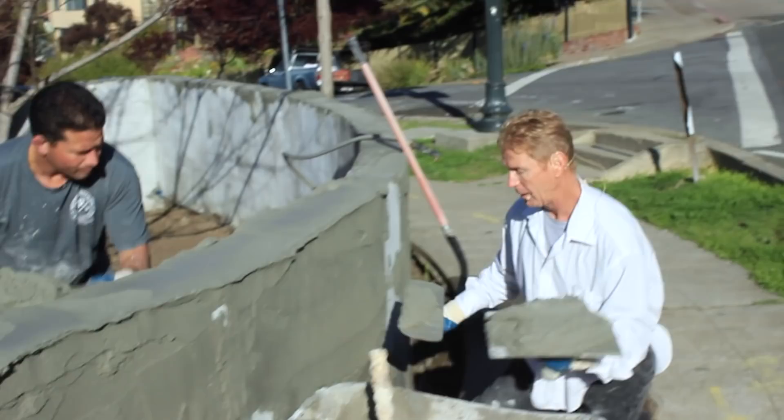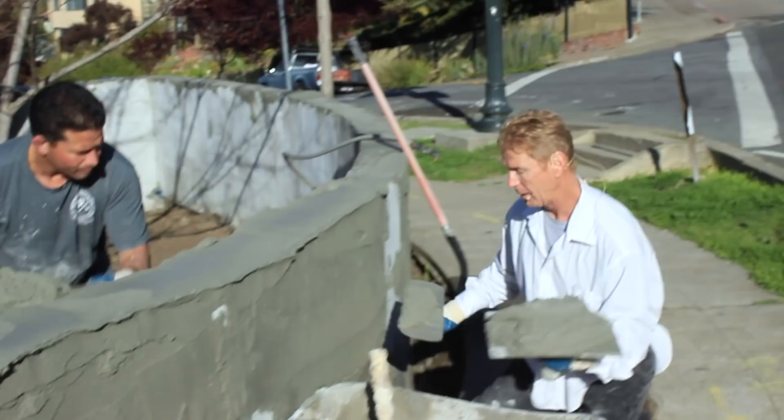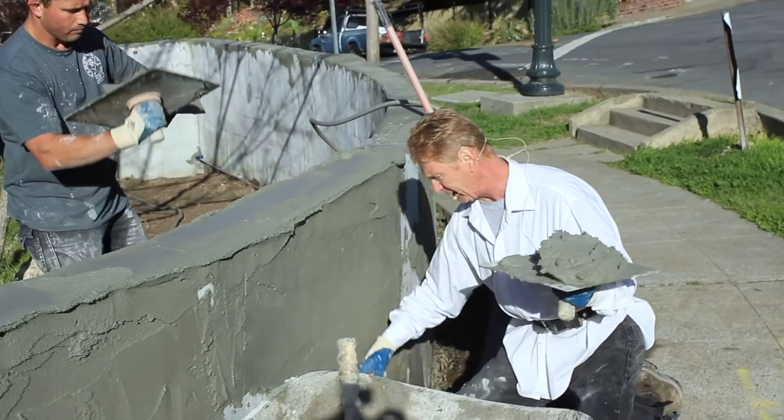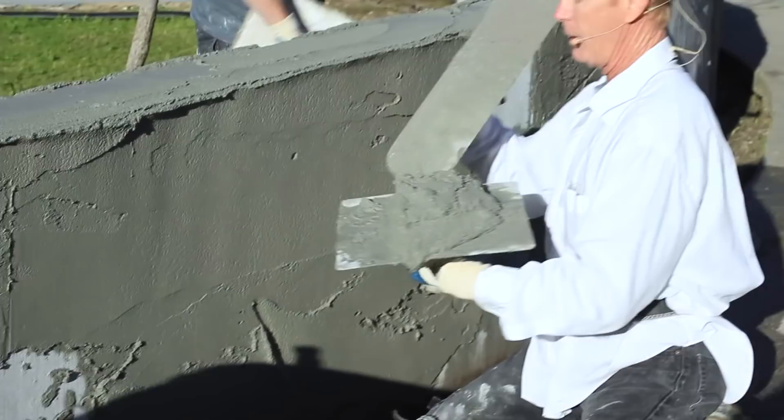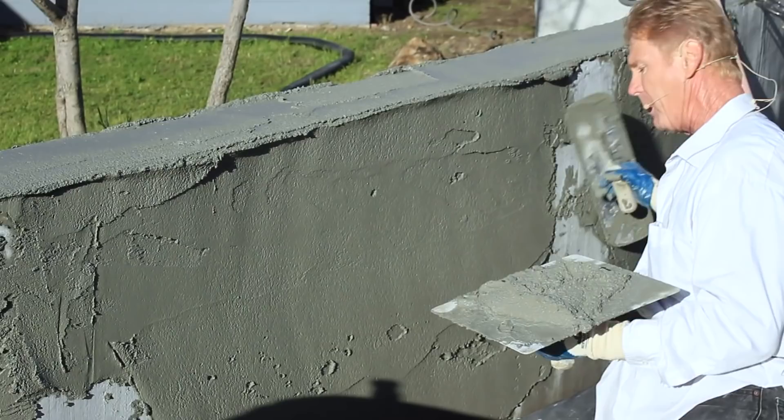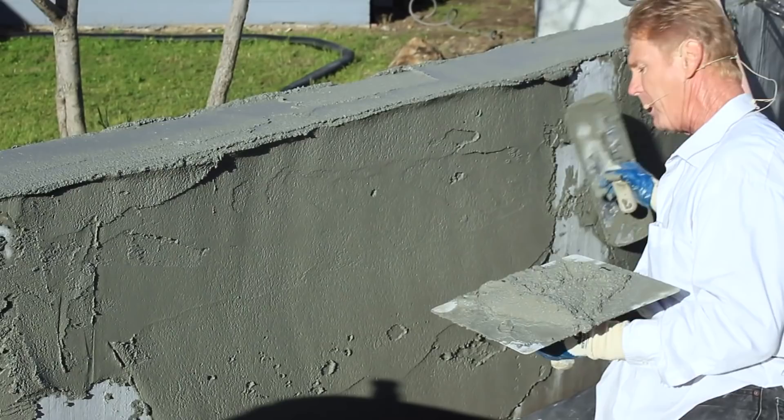Working right with you brother. The build-out just takes a little bit more. You notice I'm not pulling it up like this — I'm taking it off, putting it at a slant, turning it and putting it on like that. I'm putting it on the trowel vertically, so when I go vertical I've got a little twist to it. That's how you do a buildup on a radius.